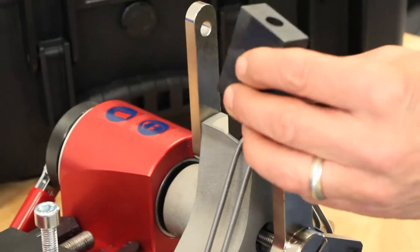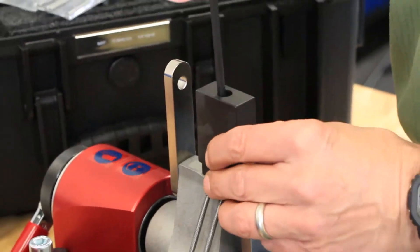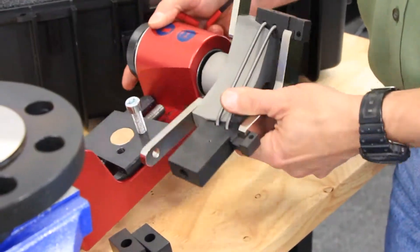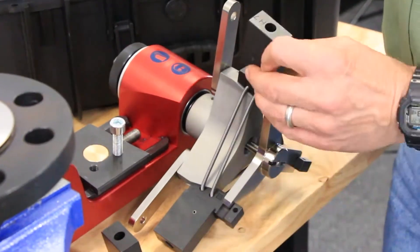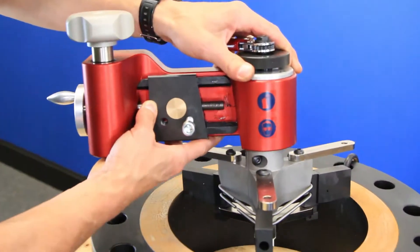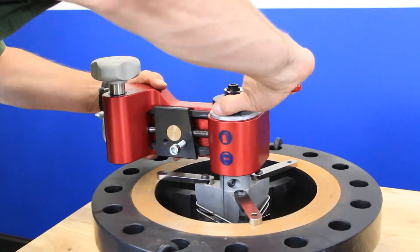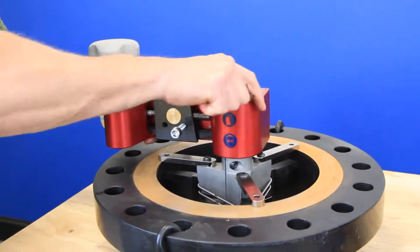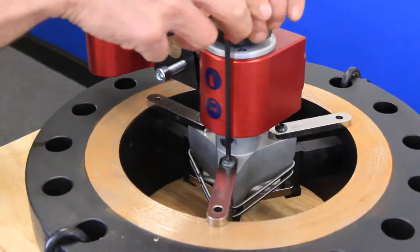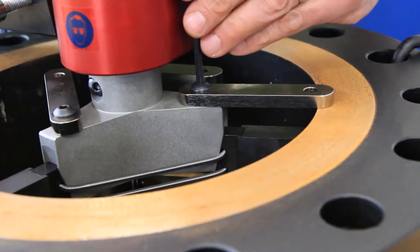Now the pads can be attached by simply matching the captured mounting screw to the rib and firmly tightening. The FlangeHog is now ready to be mounted to our larger flange. Jostling the tool is not necessary on this size flange since the large wedge fingers will assist in accurate alignment. Simply place the clamping system into the flange, tighten your ribs, and once the tool is firmly clamped, retract the fingers by loosening the finger screws and rotating them in towards the center.